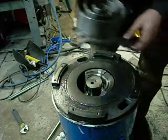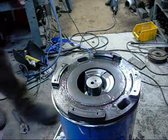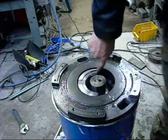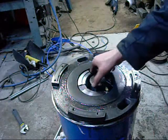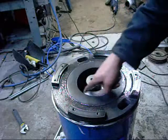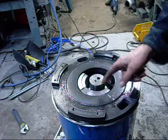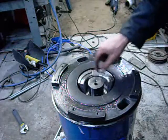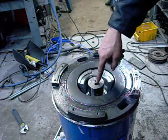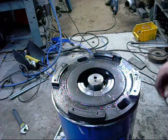Very impressive. Now there is the motor spindle. You can clearly see the eccentric lobe. There is a centre drill there for the machining on the lathe, but that is really your real centre right about there. Very nice.